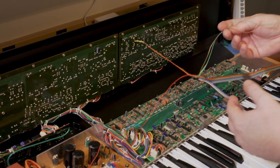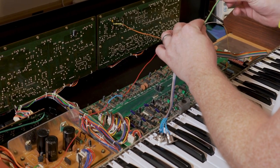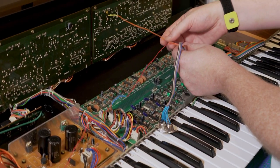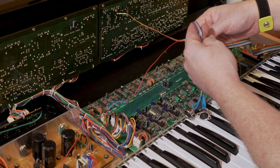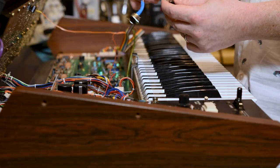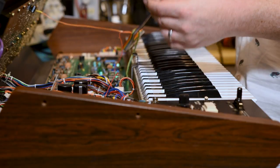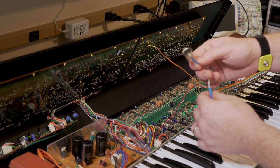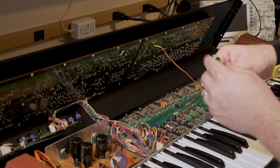There will be some unused wires when you're done — the yellow, green, and brown are unused because orange and red are being used. The blue, purple, gray, white, and black go for MIDI. MIDI In has two wires — there are two letters in the word 'in.' MIDI Out has three wires — three letters in 'out.' I'm going to go ahead and start installing those.